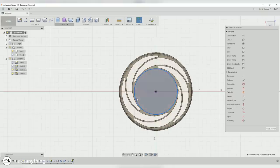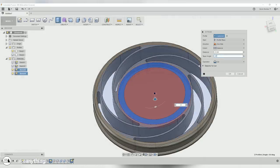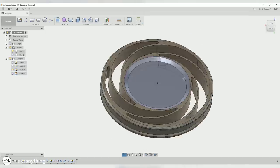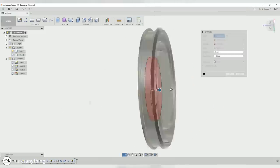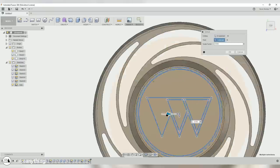Next, I want to add my emblem in the center, but before I do that I have to extrude inwards, because I can't have any features sticking out or making the puck any wider than that half inch constraint anywhere along this design. So instead I'm going to dip it inwards and have the logo embedded inside of my puck. I did that little tapered extrude, and then I'll extrude a new disc inside of there, which will be the separate logo part.